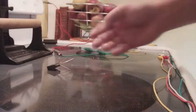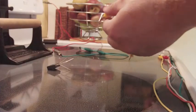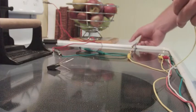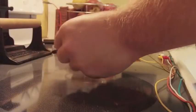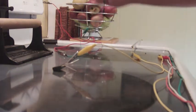I'm going to show you how you can build it. Right now I'm going to use alligator clips just for the convenience of it. I already have my alligator clip hooked to my antenna, and I like to leave the antenna horizontal — I find that it gives better results that way. Now I'm just going to hook it up to the antenna part of the bridge rectifier. And I have my ground — it's two alligator clips connected to the household ground.